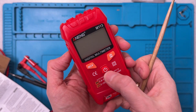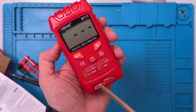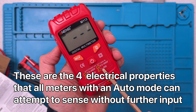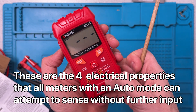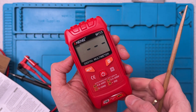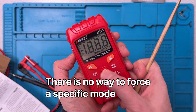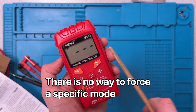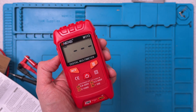Initially powering this unit up, it powers up quite easily. Looking at the unit, this only does a few things: DC voltage, AC voltage, resistance, continuity, non-contact voltage, and for convenience it has a hold function. There's a little auto indicator — this is one of the meters that will automatically switch modes. Pressing the button just turns it off again. So there isn't even any option other than the non-contact voltage to change modes on this unit. This is a fully automatic digital multimeter, given that it only has four kinds of settings.